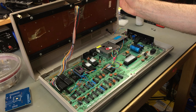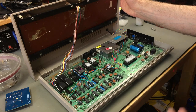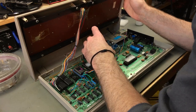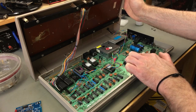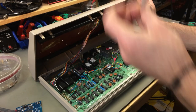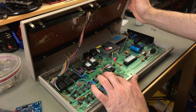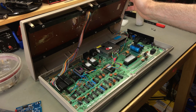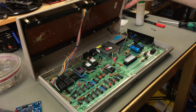Okay, so what I want to do is to desolder the RF modulator and then put this board in here, which should fit without any modifications to the case. Yeah, it looks good. And put the other little PCB, where is it? There, under the VIC-2 chip. And then video capture the output and see if we can find any peculiar things happening, or if it just gives me a much better video output, which I of course hope, because that would be brilliant.